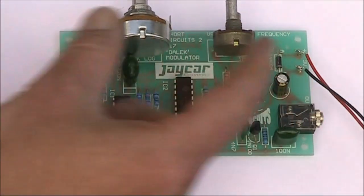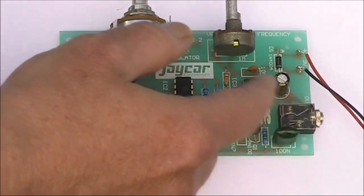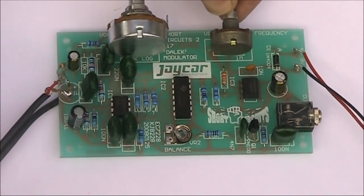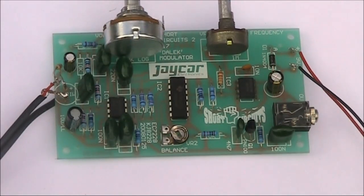So you're effectively varying the audio passband and converting it down to around 1 kHz. With that arrangement you should be able to hear not just one signal but several either side, just with the one crystal in your direct conversion receiver. Now this is into the realm of stuff that I haven't actually done yet, but it should be possible with this type of unit.